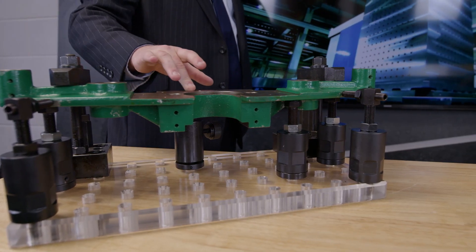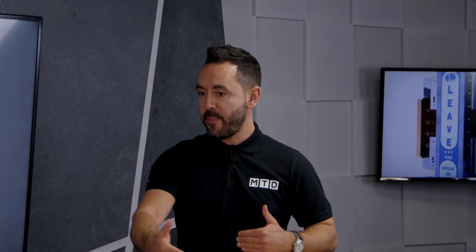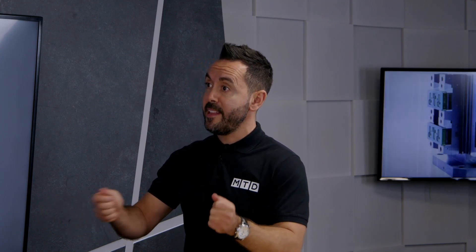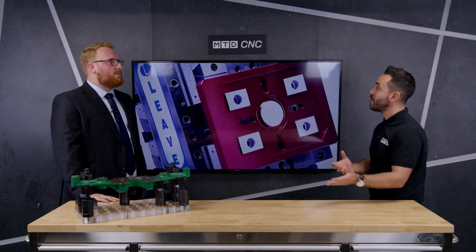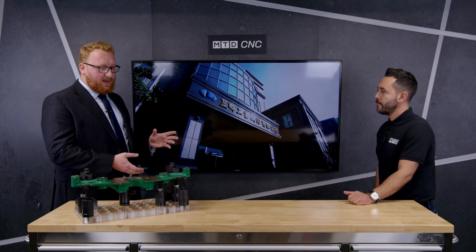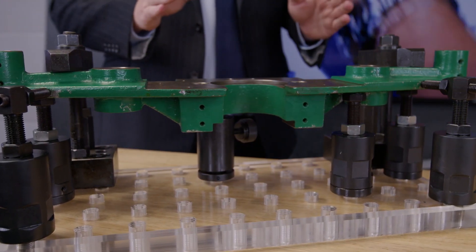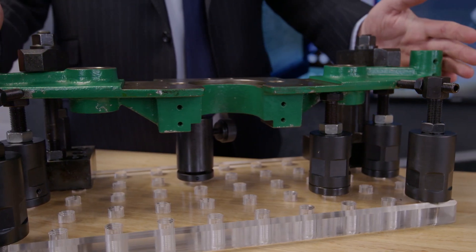So effectively it's like a Meccano set for engineers. If you're doing a one-off, you could quite quickly build it up onto your machine bed. But if that particular part went into production, you could actually build up that fixture onto a fixture plate, put maybe some zero point points on the base, and literally have a selection of fixtures made with this equipment. One of the main advantages is to keep standardised equipment on the shelf so you can very quickly build up these fixtures, take them down, put them back on the shelf. And the fact that CAD models are available for all of this means that you can build it in your design software and then assemble it.